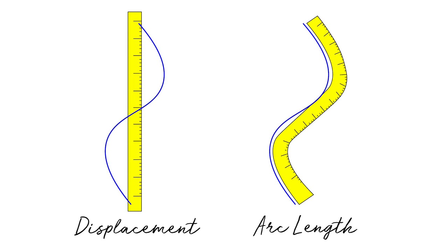So once we got the garboards installed, we started lining off the hull. Basically, lining off consists of finding out where all the planks are going to land on the transom, molds, and stem. Central to understanding this procedure, at least in my opinion, is understanding the mathematical notion of arc length. Arc length is the measurement that you get when you measure along a curve as opposed to across a curve.